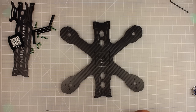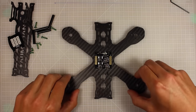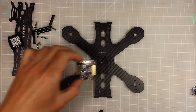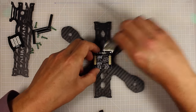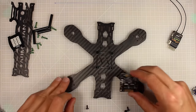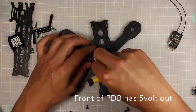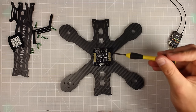The first thing I recommend is mounting the power distribution board and tinning it up, because that way it'll stay in place when we're measuring out all our wires. I'm going to mount this one with eight-millimeter standoffs — at that height we can make a nice tidy clean build and slide our D4R underneath. I've got my standoffs mounted and now I'm mounting the PDB, noting which way is front and back.